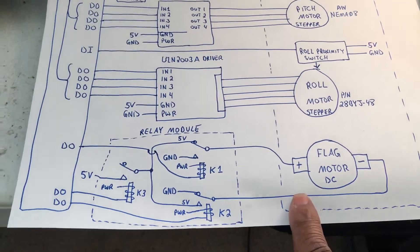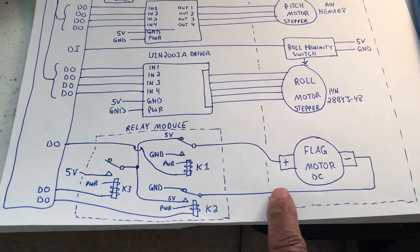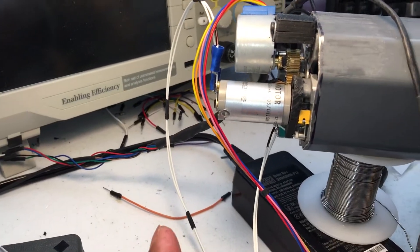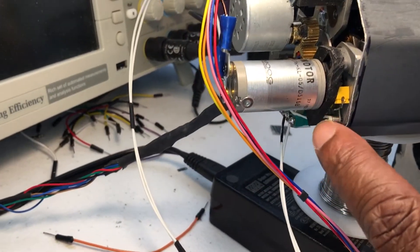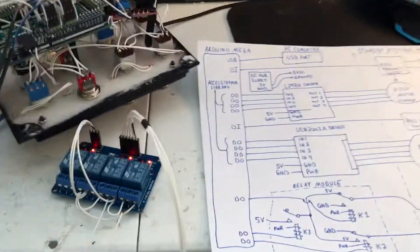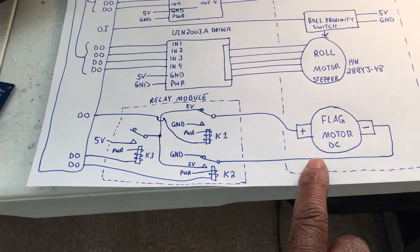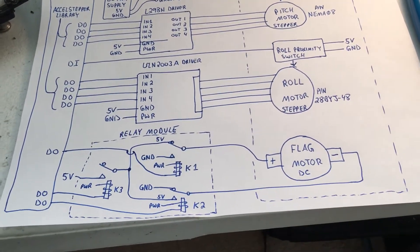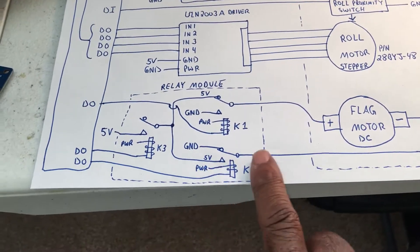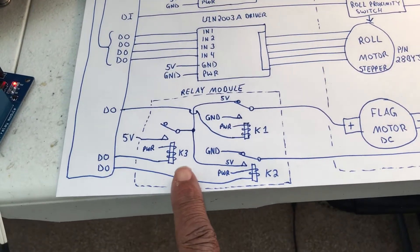Now this other part is new. There was a particular motor that came with the standby ADI but I took that out and put in a 28-volt DC motor, even though I'm only driving it with five volts — it actually worked out fine. We printed an adapter plate to mount this motor where the old one was. Usually an on/off flag is spring-loaded so that if you lose power the flag shows up and you have to energize it to move the flag out of the way. But for whatever reason this one requires driving the motor in both directions in order to retrieve and enable the flag.